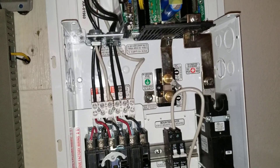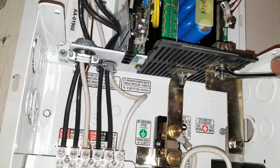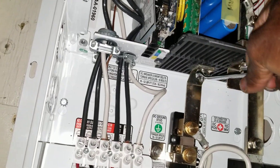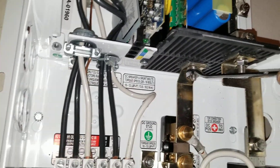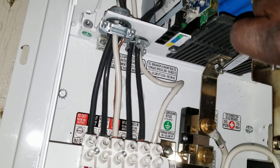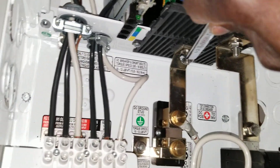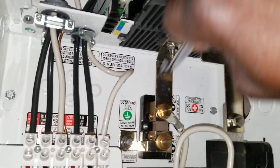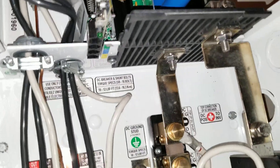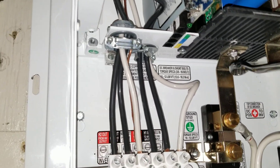This is what it is. We've gone far and I double check, triple check that all my connections are really tightened up — we don't need any arcing. And actually I almost missed this one — it's not even tightened off, the neutral or the negative. Wow, that would have been a loss of power, but I got it all tied up now.